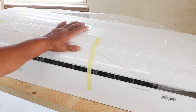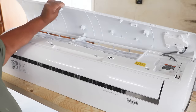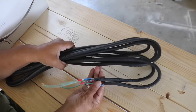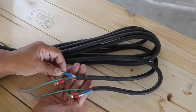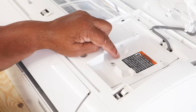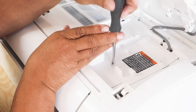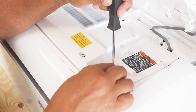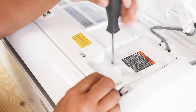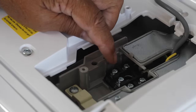So I've turned it back on its back. Now let's take the plastic off of this and open the front of the unit, because what we have to do is attach the signal wire, and we do that from inside. We're going to slide over to the wiring cover plate and remove that. I'm going to take a Phillips screwdriver and remove this cover. Underneath it is the terminal block. We'll lift this cover plate off, and that reveals the terminal block.